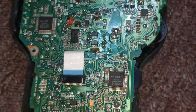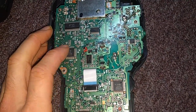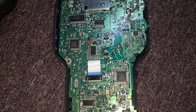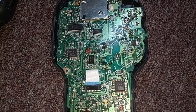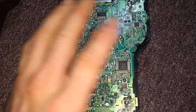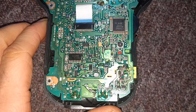And then the big problem, of course, was the capacitors — so many capacitors. They're on the other side of this board, a bunch of SMD caps that were just leaking everywhere. You can see it kind of damaged some of the traces when I removed some of them too. The chemicals, the fumes they were emitting — even with a very strong HEPA air purifier and a huge window open — just reeked so bad for days. Lots of cleanup with isopropyl alcohol and Q-tips to get rid of all the corrosive material from the leaking electrolytic capacitors.